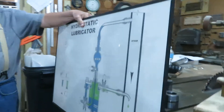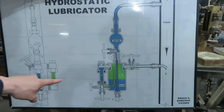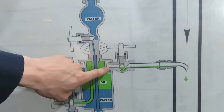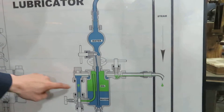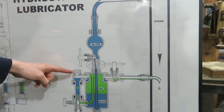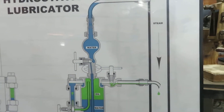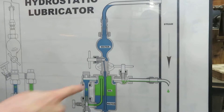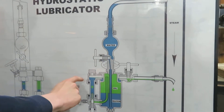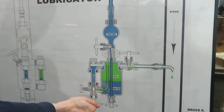If you ever want to start one of these from empty, you need to fill this with condensate first. Before you start any oil going, simply open this tap and that tap only to fill this up. It will slowly condense in there and rise all the way up. You should wait a few minutes before it leaves the top of the glass, because if you don't the oil can go everywhere and make a mess. So you fill it with oil first, then open only this valve to fill this column up with condensate. Once this has already filled up, make sure this is shut, open this, let it warm up, then crack your metering valve and get the oil flowing.